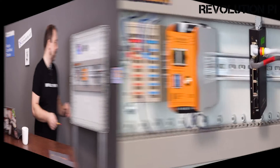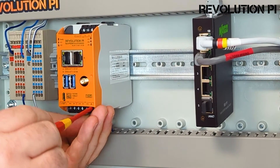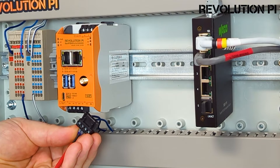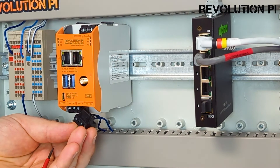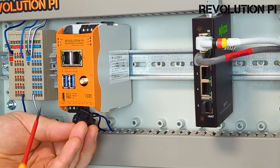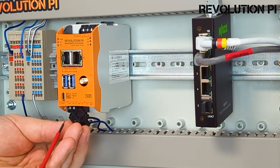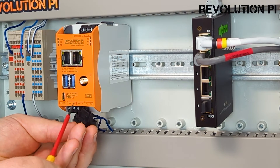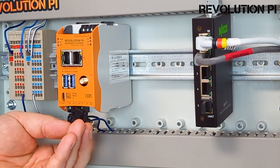I will put them away and we will look at the connectors. Coming over here, we can see there's a small connector down here — this is where you put in your power supply. 24 volts goes in on the left, 0 volts on the right. And if you have an older version like the version 3 of the Connect or the SRSE, you will need to have a cable bridge between 0 volts and the watchdog, because otherwise the watchdog will keep rebooting the system. If you have a newer one, that's not a problem for you at all.